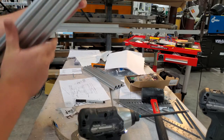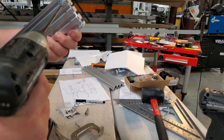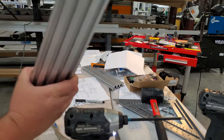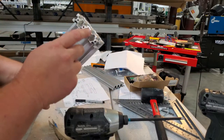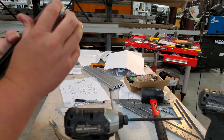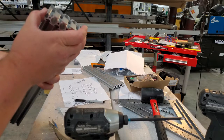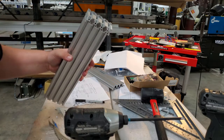Push my other side up the same way — this one didn't need the quarter-inch hole. There you go. Now I have an alignment — 5/32 right through here like I did the last one. Go ahead and widen my hole, and now one, two, three, four screws — it's a nice corner joint, no problem. Use the metal itself, it has a really great center on it, no issues there. That's going to be a real good joint. Thanks for watching.